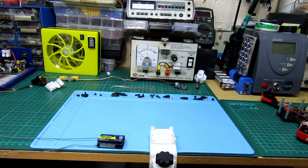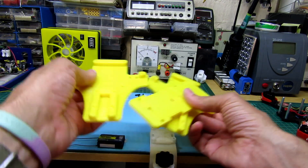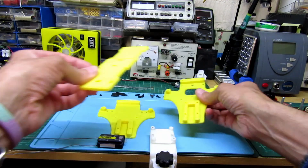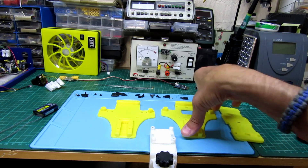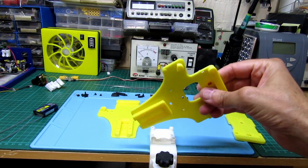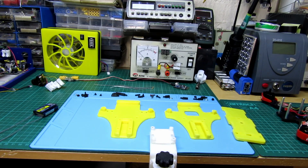I kept the faulty board and thought: what could I use it for? Then I thought tricopter, because I could get three of the motors working. I needed PWM for the servos and I had to remap one of the pins to get it working. So I'm going to use that in a tricopter build — I'm 3D printing a few parts including a base plate, and I'm just waiting for some carbon fibre pieces.